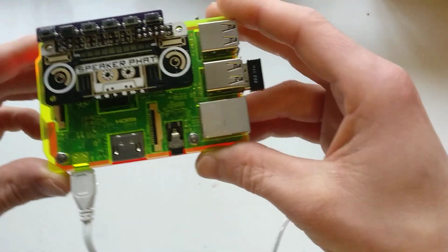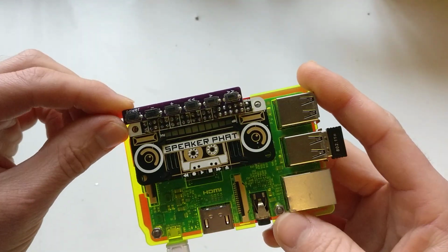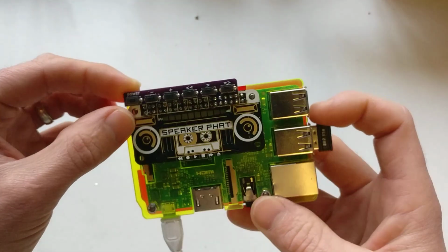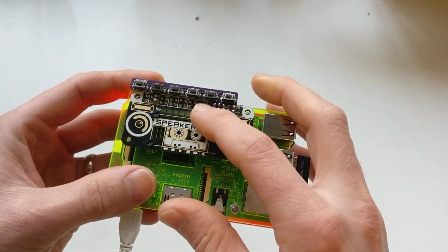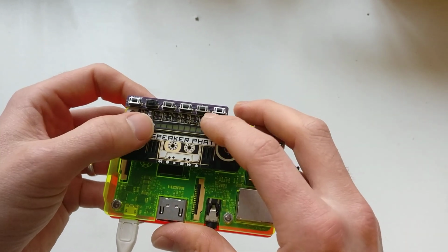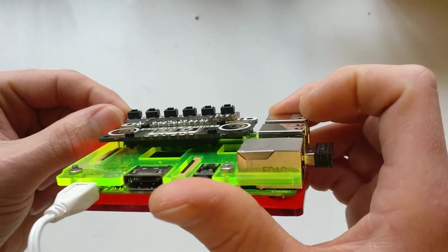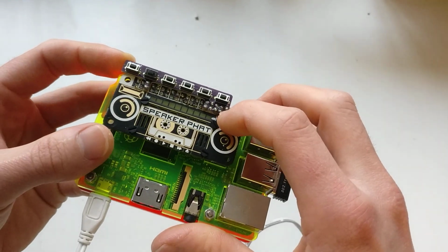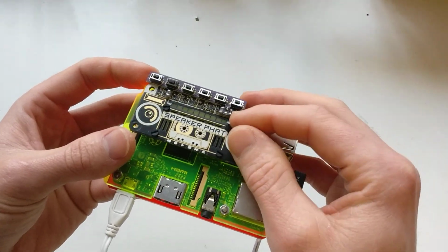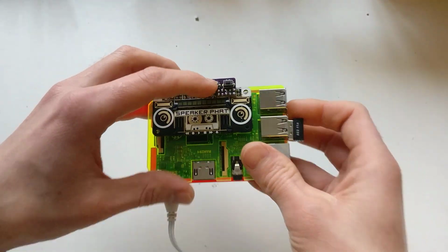So what I did was design this board here, which is kind of a shim, to use the Pimoroni term, that adds onto their board. What I did was just remove the solder around the existing pins, because I already had this soldered up. Took as much solder as possible, seated it down so it's flat, and then just put a blob of solder on, held it on for a couple of seconds just to make sure the heat goes down into the other pin, and they all join together, and it works fine. And I'll show you now.